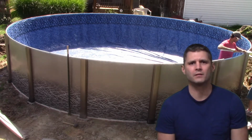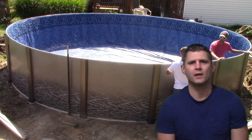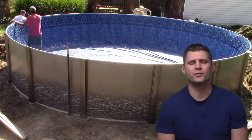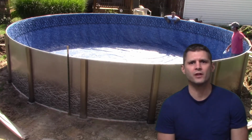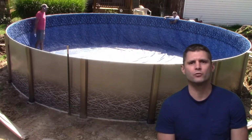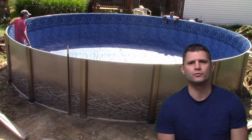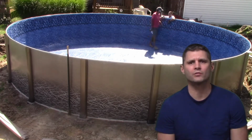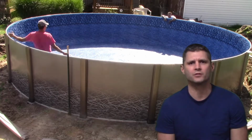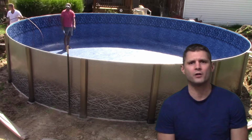Also keep in mind, if it rains on the sand before you install the liner, the liner will stick to the sand once it is hung. If that is the case, try to center the liner properly before turning on the vacuum. You may need to use rubber shoes that stick to vinyl well, like muck shoes, and work the wrinkles out manually under these conditions.